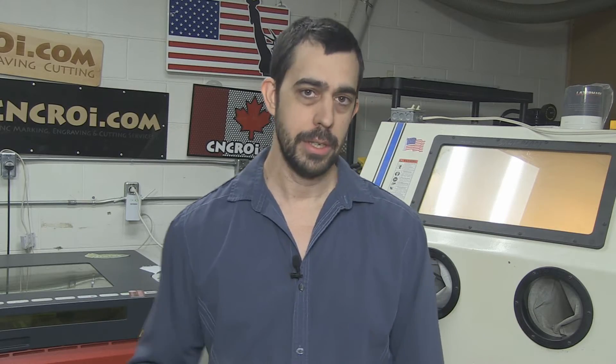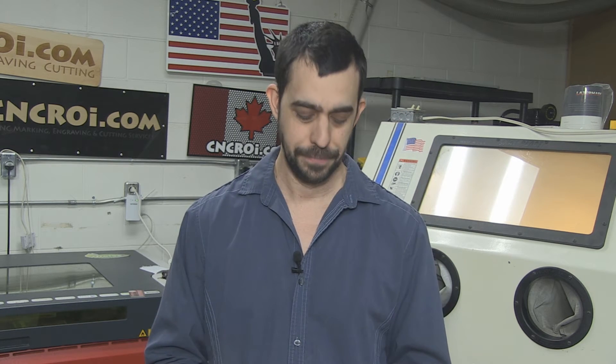Now to the fun part. This here is an industrial sandblaster that we use with a lot of our customers. The reason why I put these tags in there is to find out how durable what we do actually is. A couple of caveats: the amount of pressure and grit coming out of this thing — I don't think you'll find anything like that in nature. We're going 80 PSI using regular beach sand. This thing would blow the skin off my finger in about a second. We'll do it on the annealing, the etching, and the deep etching, and we'll also do it with anodized aluminum.